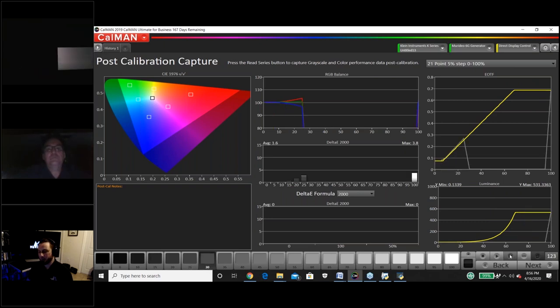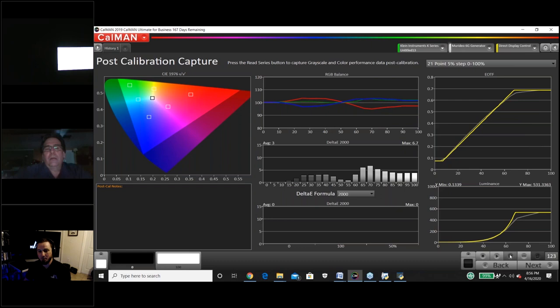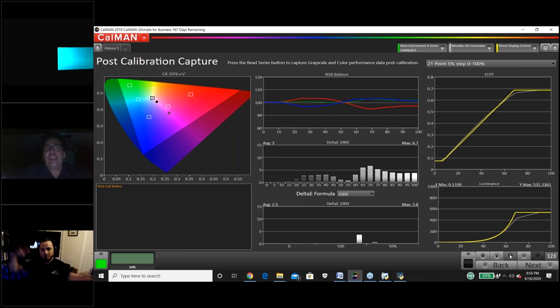Gregg, what would you say is the big improvement visually on these projectors once you get the EOTF to track correctly? Is it more detail everywhere, midtones, dark tones, and bright tones? Oh, it's everywhere. There's less clipping of the image, so you're going to see more detail in the specular highlights. Better black detail, because you're going to have more light output in black, so black's going to have less crushing. But the first thing is you've got to get the light output. So for this generation and the next generation, definitely use the RV curves to get more light output into the projector.